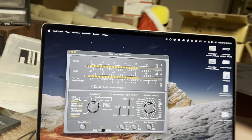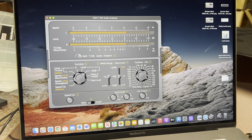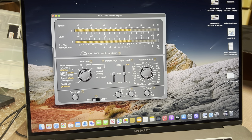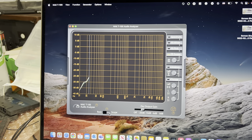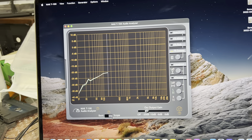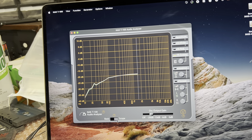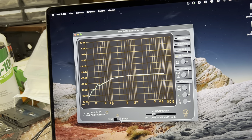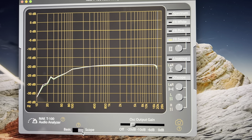Something is wrong with the tape on the right channel - it's a little bit too much. Let's adjust it - it's pretty sensitive. Source versus tape, okay. Now let's see the frequency response: about 1 dB difference here, pretty close. Equal at 15 kHz. A little bit of difference around 20 kHz between the two channels.